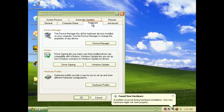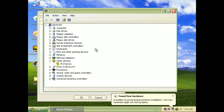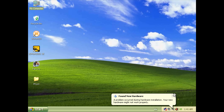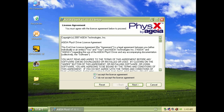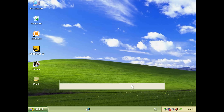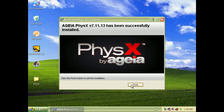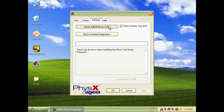So here is the smoke test. I installed the card — it needs a Molex power cable from the power supply. After turning on the computer, the fan spins. There's an unknown device in Device Manager, so that's looking good. The drivers are installing fine. But unfortunately, hardware acceleration does not happen, and in the driver control panel there is a diagnostics process you can run, and it throws an error.